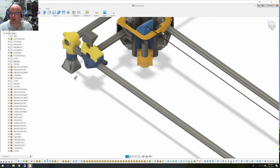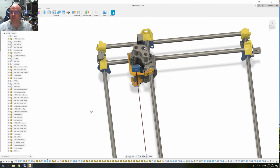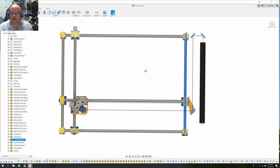One thing I will say is I always dual end stop the CNC before I start a cut series. One of the reasons is, let's back up a little bit, if this motor here and this motor here get a little skewed out of each other, they're not quite on step and step. When a job stops, it disengages the motors. If this were to skew a little bit, it changes the angle of this mirror, and suddenly I could have this beam hitting down here on the side of the aluminum or out in free space. And so just by zeroing it up each time, the motors engage, it goes to true where I've actually made all my measurements, and then I continue from there.